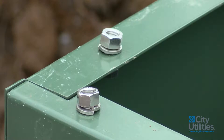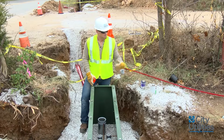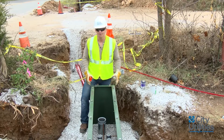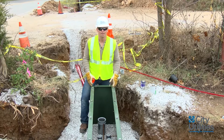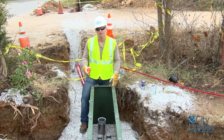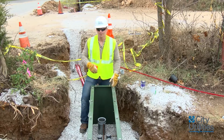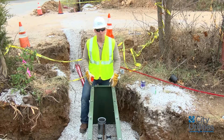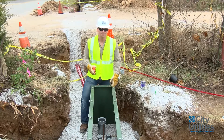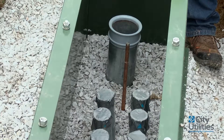This junction cabinet will also be backfilled. He'll probably put a little bit more gravel to make sure that it stays where it needs to. As long as he's got proper backfilling material — this is just a dirt area — he can go ahead and put the dirt on around it. In some areas we require 100% gravel backfill because of the location, such as inside a parking lot, up inside the top of a curb, or some kind of commercial area. Be sure and get with your engineer or inspector to clarify what type of backfilling material you may need for a location like this.